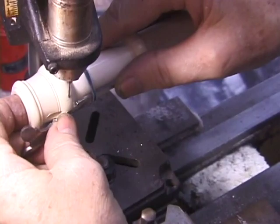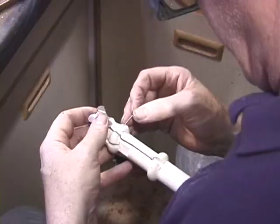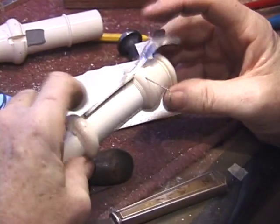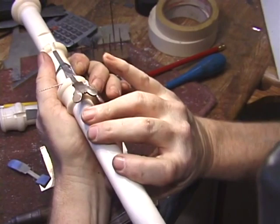Now we're working on the long C natural key here, made from a little bit heavier silver to get more strength for its long reach. We want to make sure that these silver keys are set up with the right angles and the right curves so that they are easily reached by the average player's finger there. They can go from one key to the other with facility.